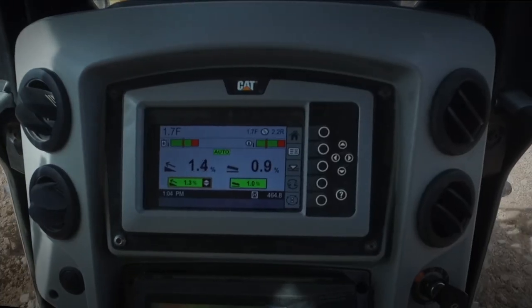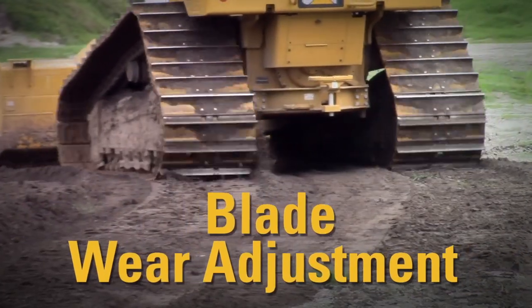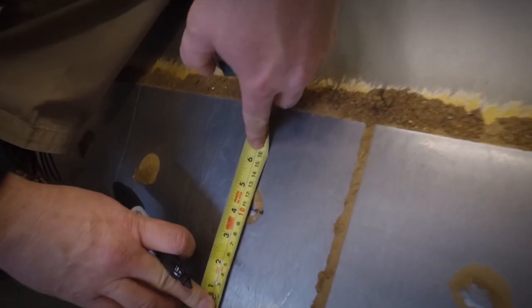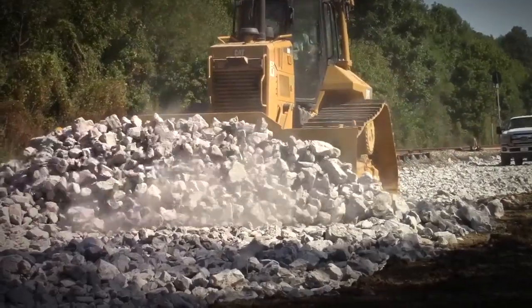Like any tool, to achieve the best accuracy, you'll need to keep it in adjustment. One of the key adjustments for slope accuracy is the blade wear adjustment. As your blade wears, this number will need to be updated. The abrasiveness of your material will dictate how often this needs to be adjusted.